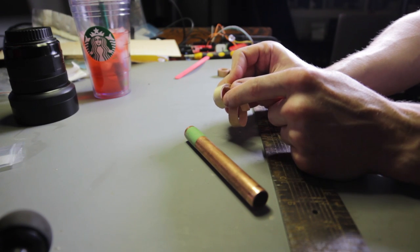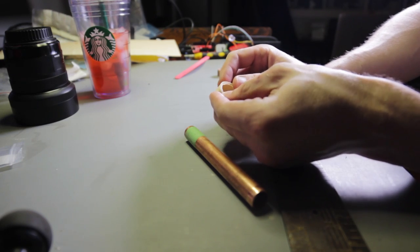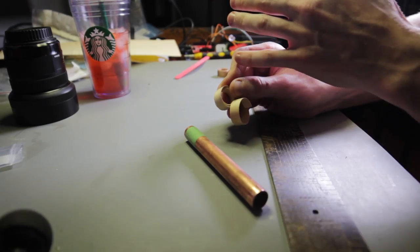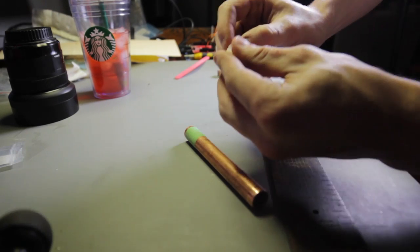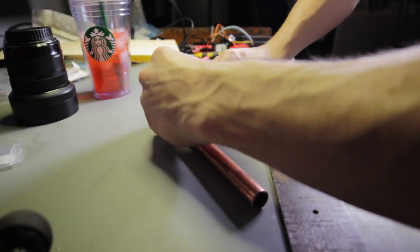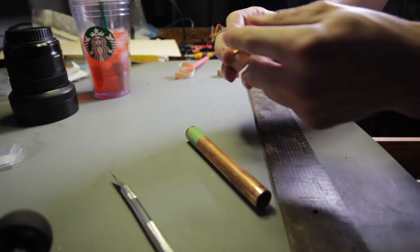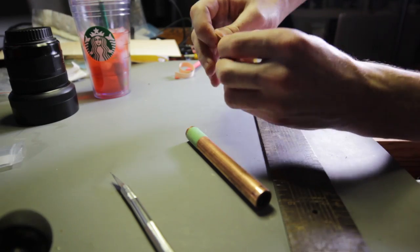On the third layer we're going to put in the RFID tag. You can always sand the inside bigger to make more room so you don't sand into the RFID tag, but you don't need to sand down from the outside. So cut it off there, and then we're going to sand the ends of each strip so they're tapered and get really thin, since the veneer still has some thickness to it.